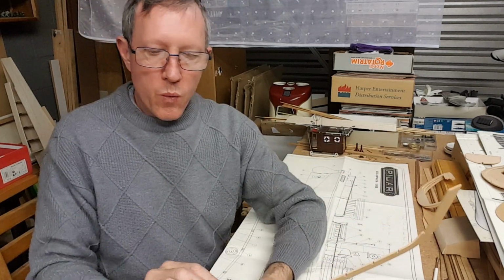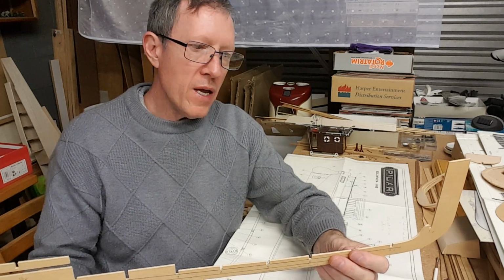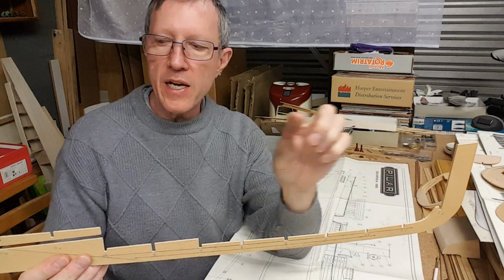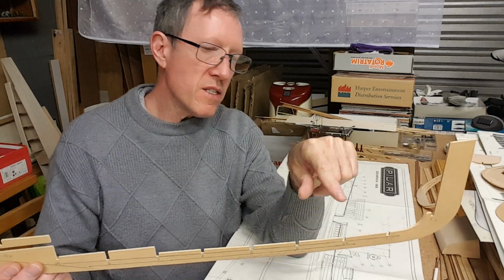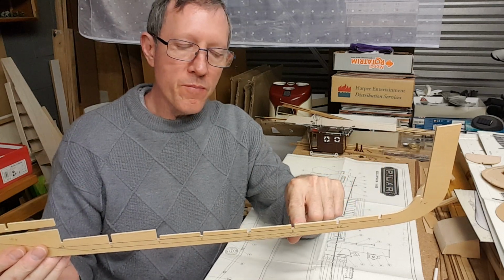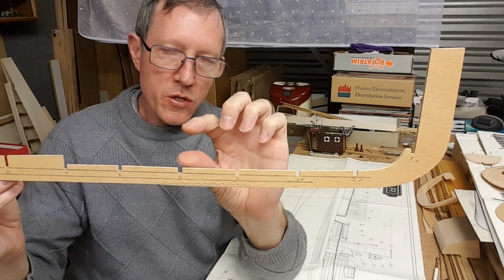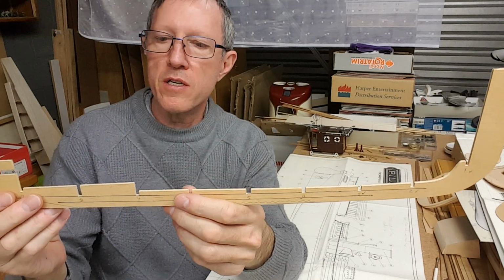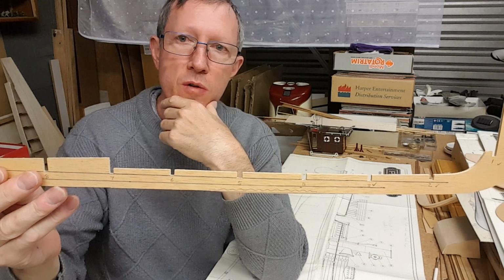So when I mentioned that this really needs to have a rigidity on its shape, that's very difficult by placing the deck on before your bulkheads are giving it any rigidity, and yet it's the deck that's providing the basis for the positioning for the bulkheads. And relying on those cutouts so that your bulkhead slots into them exactly to provide you with the perfect height would not be a correct approach. You just need a couple of these cutouts to be not quite correct.